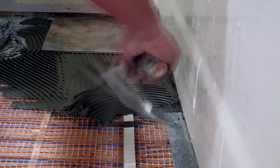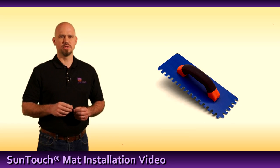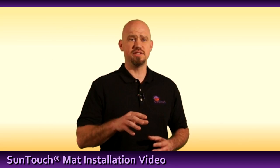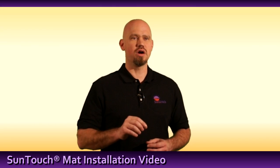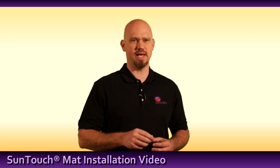We recommend using a latex modified 3/8 inch thick thin set. We also recommend using a plastic trowel, such as our cable trowel. A self-leveling mortar can be used when installing under laminated hardwoods, carpets, etc. Regardless of the floor covering, the mat must be fully encapsulated in a mortar bed.